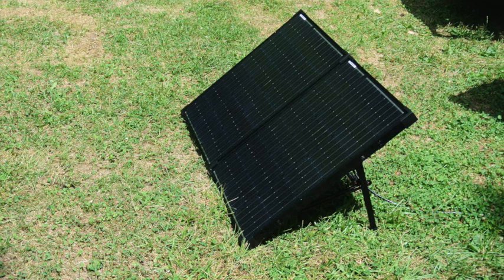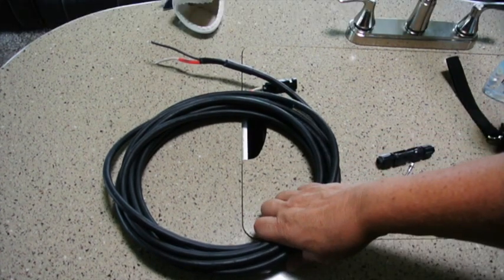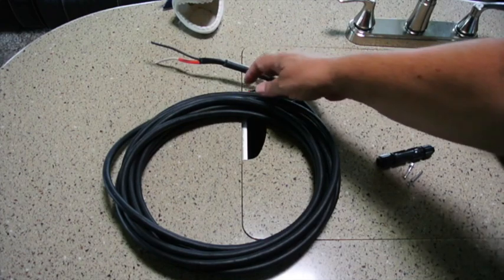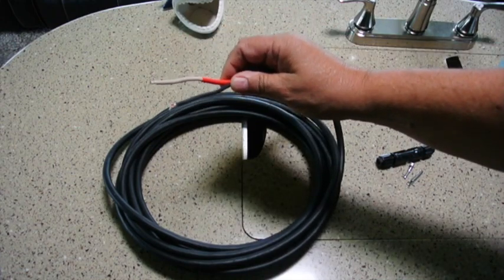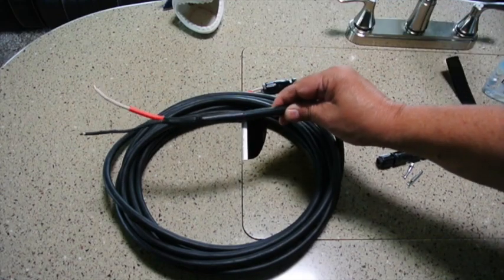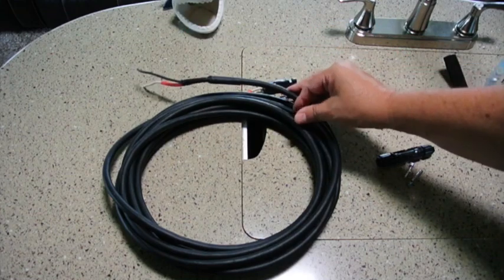If you've not watched video 3 part 1, I will provide a link to that video here. In order to demonstrate the different hookups for the solar controller I had to buy some cable. This is a 25-foot cable of what is called SJOOW, which is a type designator for cable. SJO basically means a 300-volt cable — it's a standard extension cord type cable but heavy duty — and OW means that it's water resistant. It's only 2-conductor, 25 foot.